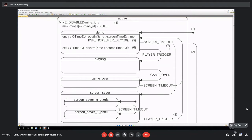it's just a set of C macros that keep things clean, that help with the repetitive nature of how you set up the code to create a state machine, where you have an initial state and then want to do certain things every time you exit the state, and every time you enter that state maybe there's an action you want to take. So I've at one time created a couple of C macros that in the end make that look clean and compact, but under the hood it's fairly simple. Not much of a framework and not much of an event distribution scheme around it. Just keeping it real simple, with the intent, for me usually, to keep the code clean.